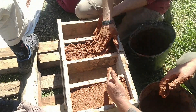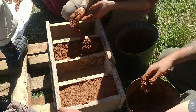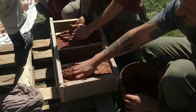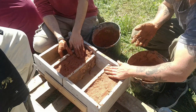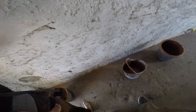When these are dry, you push the block to one end, measure the space, and find that out as a percentage of the 30 centimeter mold. It can't be more than 4% shrinkage. The longer the mold the better — then you can see exactly how much it's short. We start out the application with water, then clay slip, which is fine filtered clay with water.